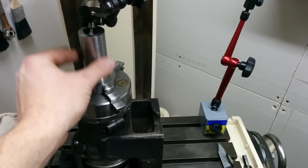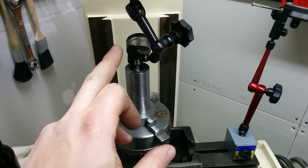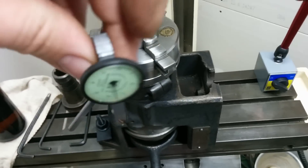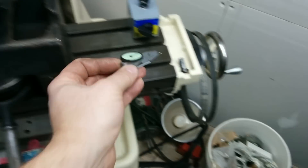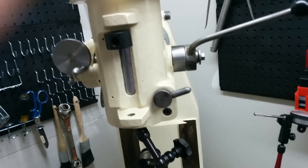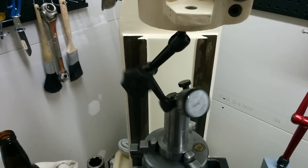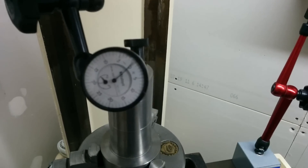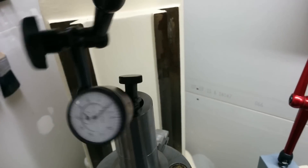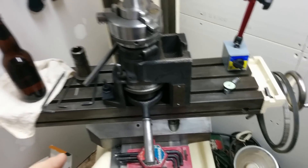The next step was to center the workpiece underneath the spindle. Normally you'd use this type of dial for centering on a hole, but I didn't have enough room to manipulate it - I'm completely maxed out with the knee all the way down and the spindle all the way up, just squeaking it in there. I'm spinning the dial and using my little coaxial indicator. I've got it down to within a thou all the way around, which is golden as far as I'm concerned.